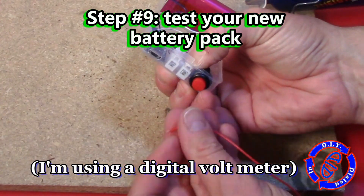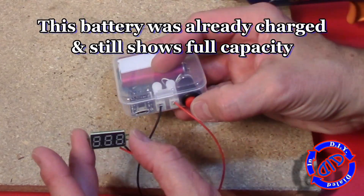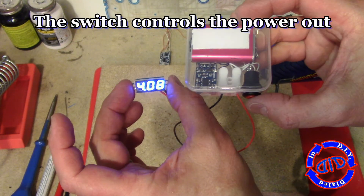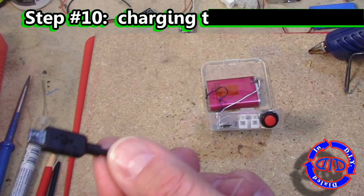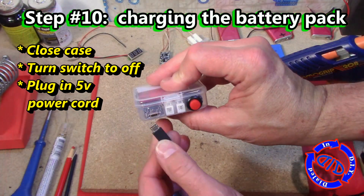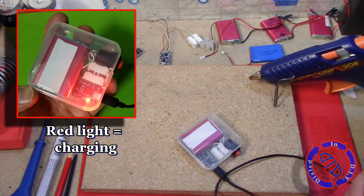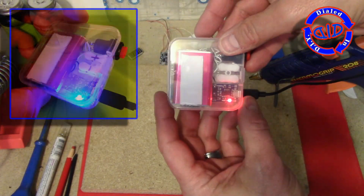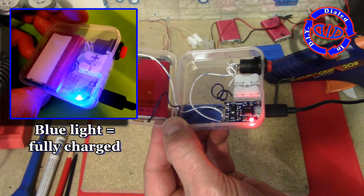I have a handy little digital voltage meter that I'm going to plug in here to test this out, but you could use LEDs or anything else you want to run your test. I'm using it this way so I can show you that the battery does have a full charge, and we've also been able to prove that the switch does cut the power from the battery. For charging, this little chipboard is designed to take a 5 volt USB power source, so grab your connectors and plug it in. Connect that to the wall and when you see the red light come on that means your battery is now charging; when it switches to blue your battery is fully charged and ready for use.